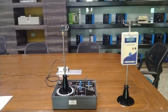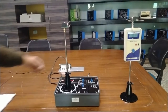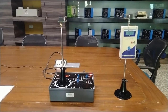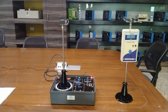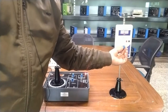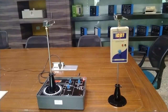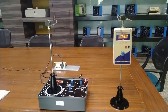Switch on the main unit and check the display of the directional coupler — it will show some reading according to the level knob at startup. Now we will turn on the kit. This is showing 103.4 µA. Switch the RF detector on and keep the level knob at the middle position. Adjust the level so we get a zero reading at the middle position.